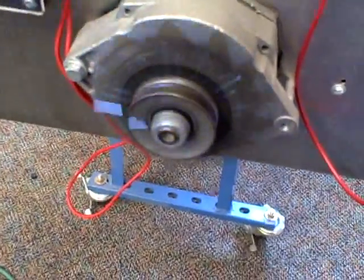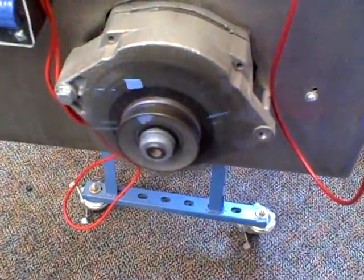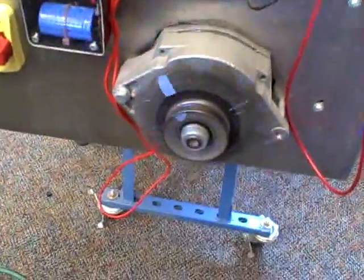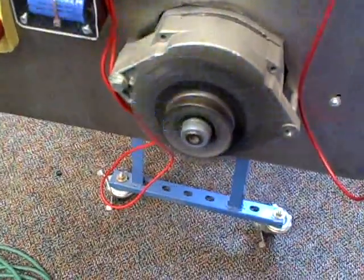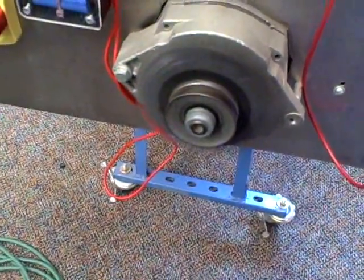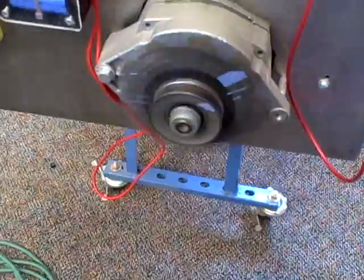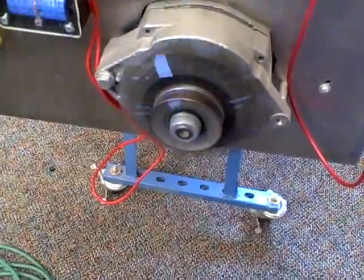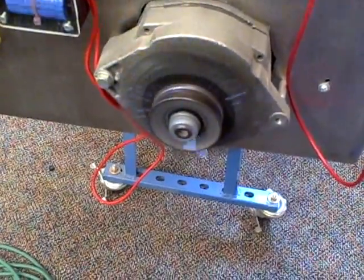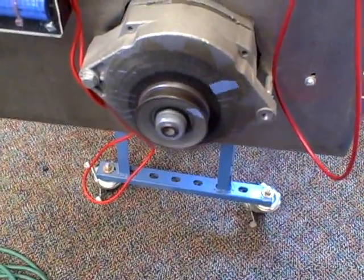So you have to be careful when using a stroboscope that you're not flashing the light at some factor of the motor speed, but rather you're flashing it at the motor speed. Here's how we tell: if we've got it locked in and we're wondering whether this is the right speed, or are we catching every other rotation — you just increase the strobe speed and see if you can get it to lock in another time with it standing still in one place. If so, you're going too slow. And here we have our true speed at close to 1,800 RPM.